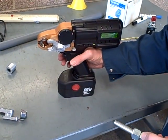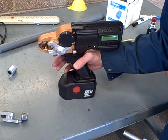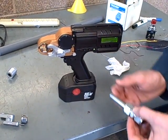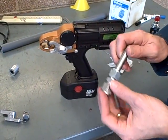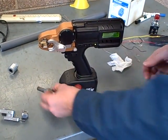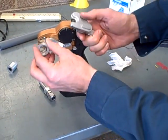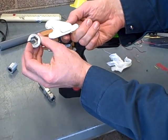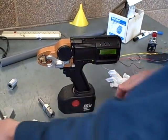I can send this thing back to the home position by touching the trigger one more time. Of course, you don't want to do that with the fitting engaged, because it would loosen off the fitting, but that brings it back to the home position where you can slide the fitting in and out. We also have adapters here that'll work for smaller tube fittings — for example, one quarter inch instead of one half. We also have an adapter here that works as a tube cutter, so we can take this and actually cut a piece of tubing.